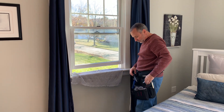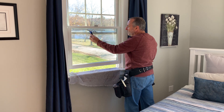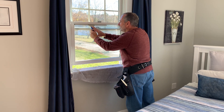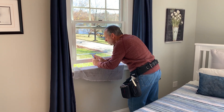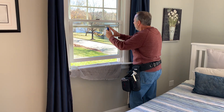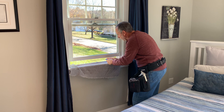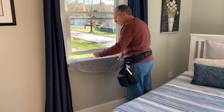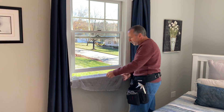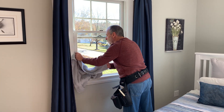I'm going to use a squeegee that's at least half the width of the window — about an 18-inch squeegee — to squeegee off the liquid including the lower part of the sash, getting 99% of the liquid off. I'm basically peeling the dirt off with the liquid. I use the lower cloth as a drip cloth to absorb the liquid on the squeegee and lower sill, then wipe off most of the liquid on the sides.